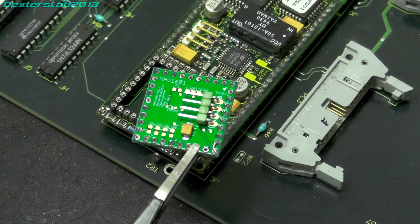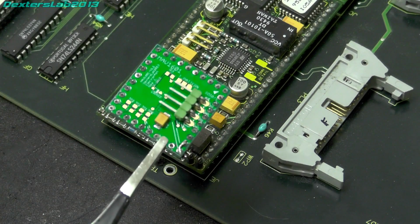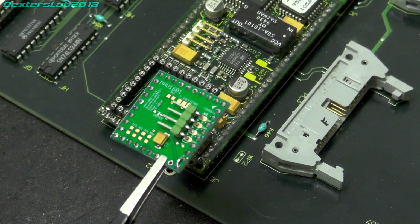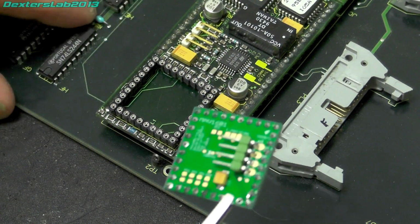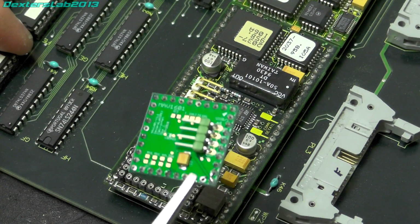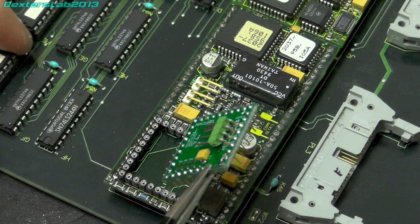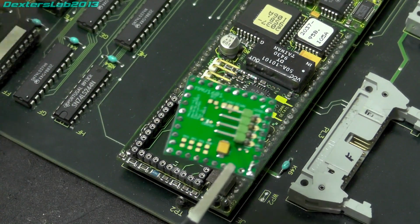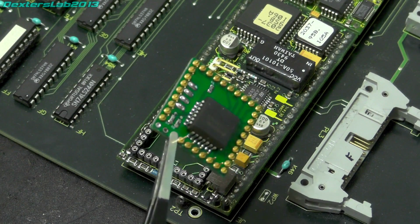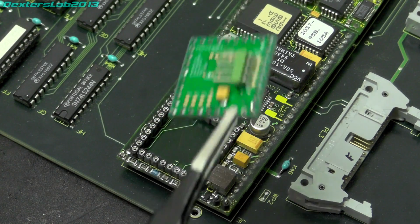I found a few mistakes. The right angled pin header, I didn't account for mine being in that arrangement. I probably should have checked. I thought it was like these ones here. You can see there the plastic sits over the actual through hole, but on the ones I've got, they don't, which means it kind of gets in the way of the capacitors which are underneath. Simple mistake. I robbed a tantalum cap off one of the older Quantel boards. Hopefully that won't explode.